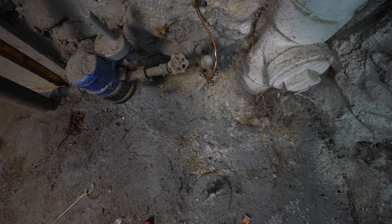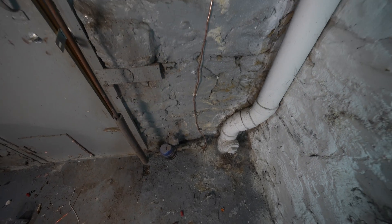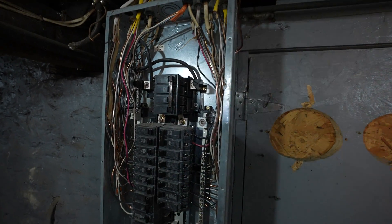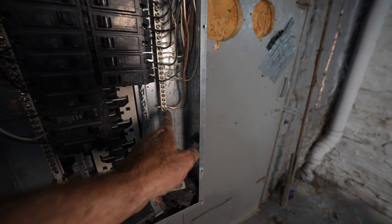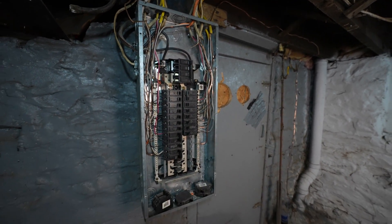Just know that some areas might require you to jump the meter — going from that side to the other side — so you might need a little short piece of copper to go over to that. But in this scenario, since I changed out everything to PEX, it wasn't a big deal. I actually changed this ground wire before I changed out all the PEX.